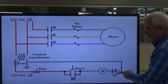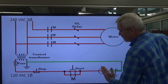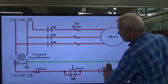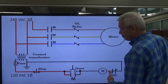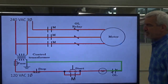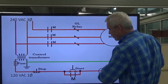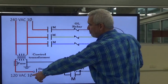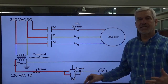That's one thing that could happen. We could also have a motor coil burn out — if the coil wraps wire around a gazillion times and it burns out in the middle, it won't let current pass through anymore. That's also going to stop the current flow and shut this coil off. We could break a wire here or there. But really, for teaching purposes, the most practical way of stopping this circuit from staying energized is to hit the stop button. It kills it back there, and once we let go of the stop button, we reestablish power up to this point. That's how a seal-in circuit works.